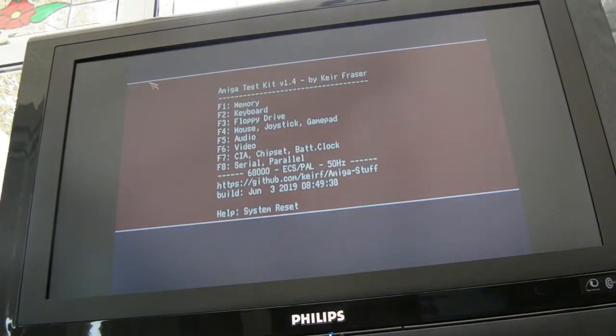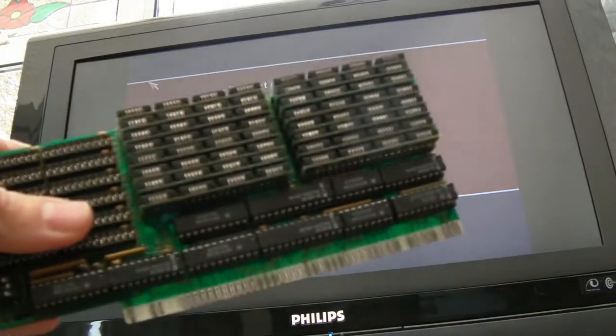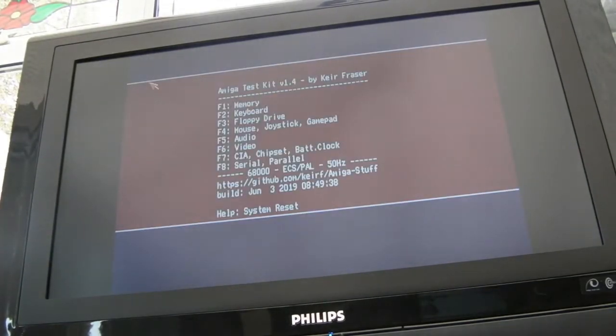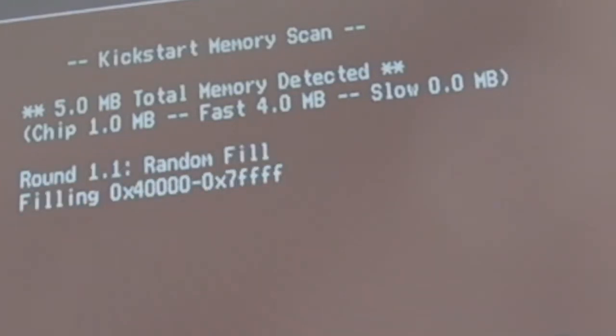So trying again without the TF534, the stock CPU this time. You can see that's worked this time, we're going to turn the memory. So the A2091 on a REV4 board seems incompatible with the TF534, but I do know it coexists okay on a REV6.2 board that's been modified. This is where things get really confusing. I'm guessing if I now stick this back in, we will have 4 meg and it should work. Yeah, it's not errored, look. Showing 4 meg fast and Zorro 2.